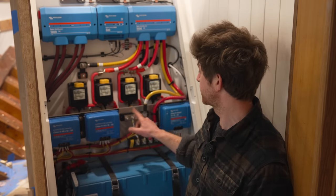Oh, me? Really? Go ahead. Give it a whirl. Engage. Wow. Yeah, and you can't turn the electric motors / generators with the engine unless the engine transmission's in gear, which would spin the prop also. That would spin the prop, yeah. So what we'd like to do is disengage the prop. Now the engine can spin without spinning the prop. So now this is a giant diesel generator. Genset. Yeah, it's a genset.